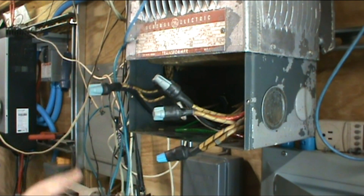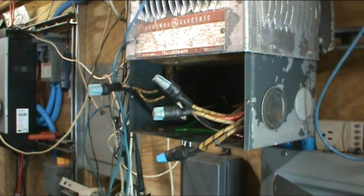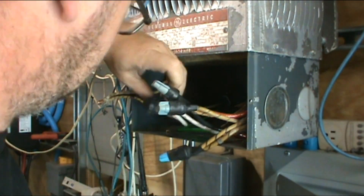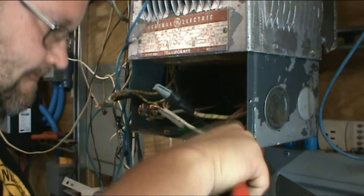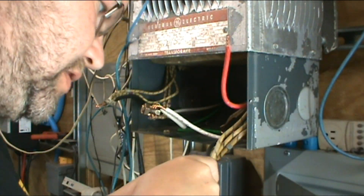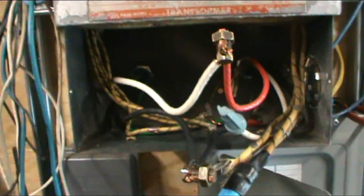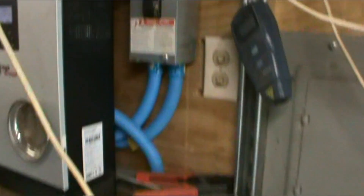The purpose of putting this transformer in originally was that I didn't know the PIP isolates everything — the neutral is isolated from ground, and nothing makes a physical connection within the box, according to the people that operate PIP. So we're going to rewire this, take everything apart, cut everything off, and I'll show you how it all works. The camera was off, but I already got it connected and switched on the breaker — nothing has popped or made a bad noise yet.